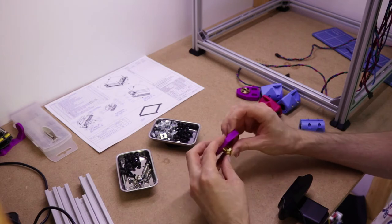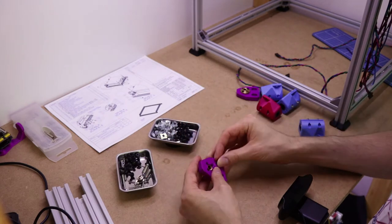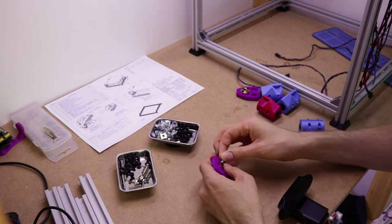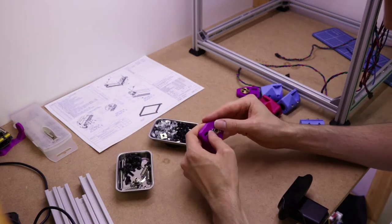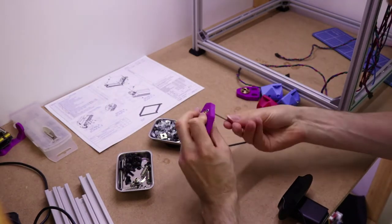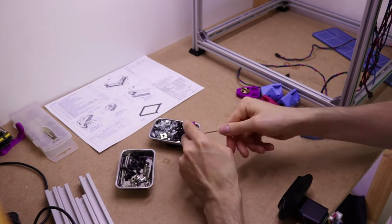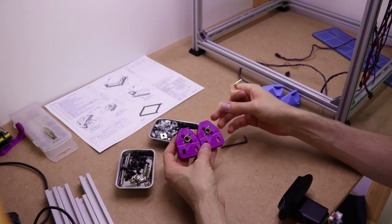As normal, you see where the nuts need to go and you put them in. That's generally a good way to start. With these, I've put four holes in, but really you only need two, so I'm just going to get two in. Okay, not too tight. If you've not tightened lock nuts before, essentially what you're doing is tightening through the nut first and then through the nylon material at the back, which is much stiffer to screw through as it's a sort of self-tapping procedure. That's pretty much all you have to do. There's two of those to do.